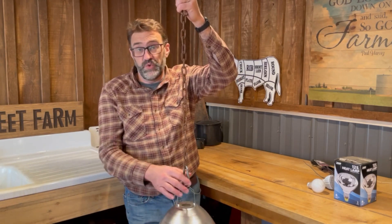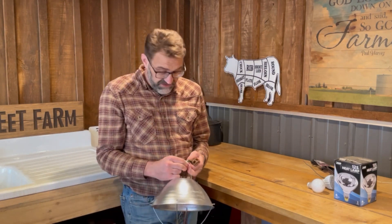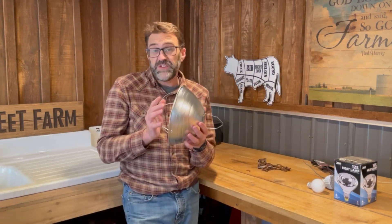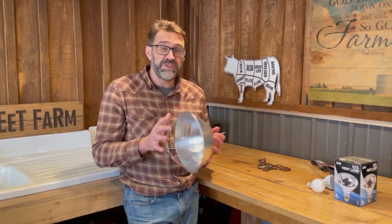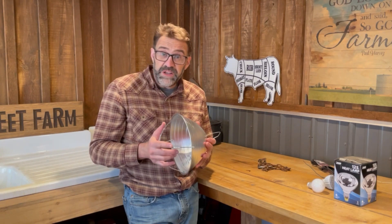Don't use something like a string — use something solid that can take the amount of abuse if an animal hits that lamp, so things move around but don't fall. Because when one hits the ground and you've got straw or wood shavings for bedding, those materials are so volatile — it won't take long at all for one of these heat lamps to ignite them given the heat they put out.